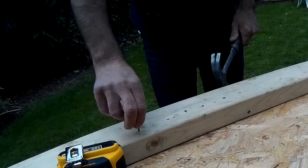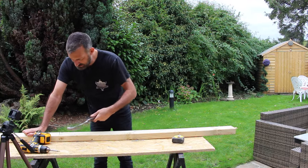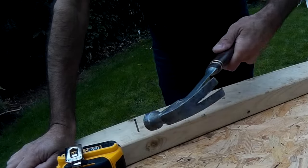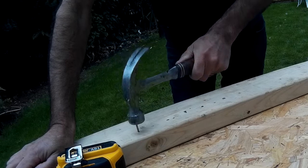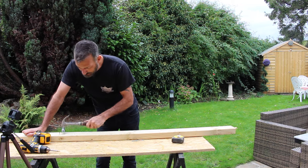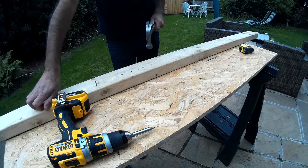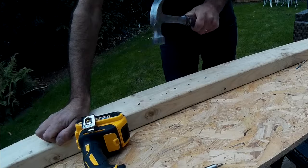Prime example — I'm hammering a nail and I've miss-hit it. That's a commonly done thing. What do you do? You can take it out, but if you just hammer it straight so it's vertical again and then lightly reset it, what you're doing is getting the bend under the surface of the timber. Then you can continue to drive it home, and the final strike takes it into the timber.